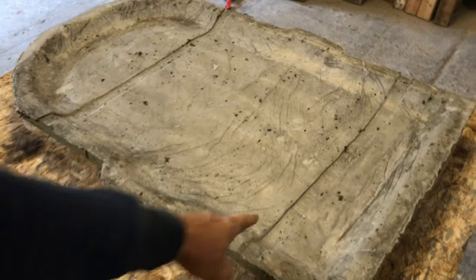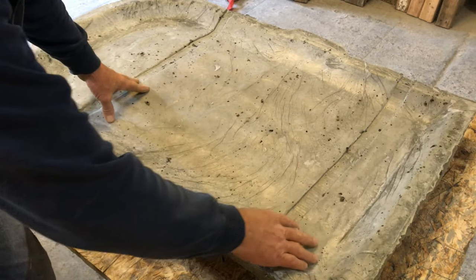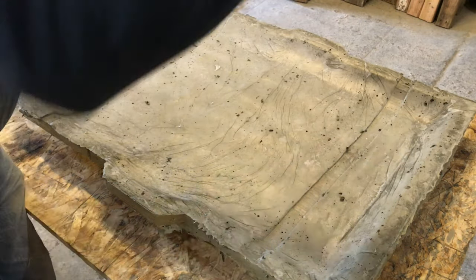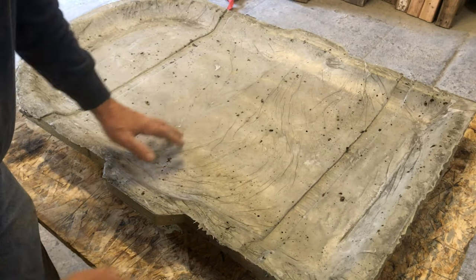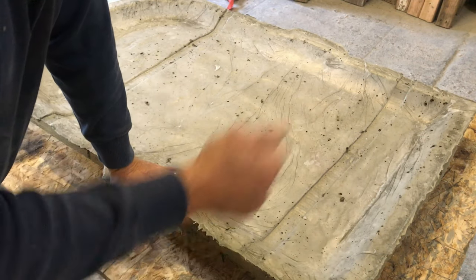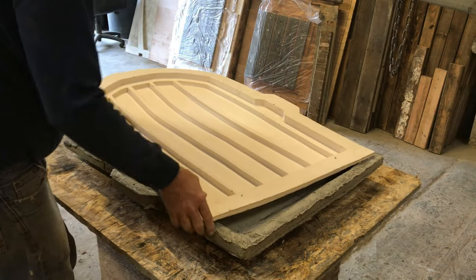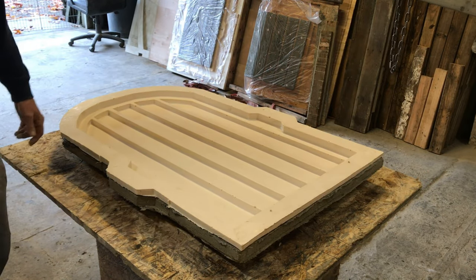You can clearly see that there are strap details in the hard mold. So when you put the rubber there, there's still enough of a channel underneath that the straps can pull for adjusting for the rigging to pull the actual casting out with the rubber. If you put it in here, even though it comes to the edge, sometimes it's difficult to get a hold of. The straps just make it easier. And that is how she's done.